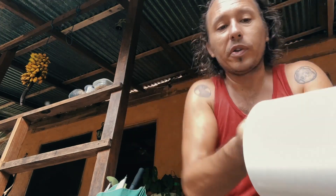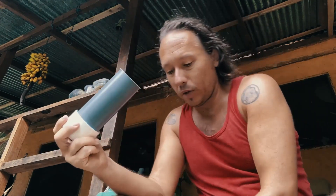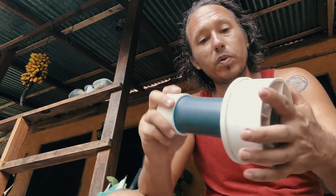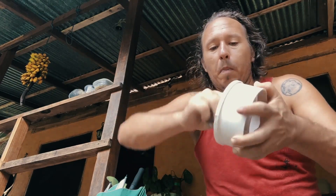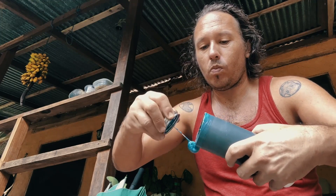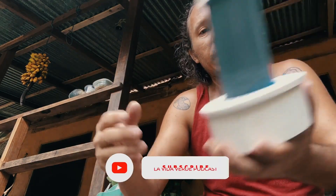Now I've got this union. I'm going to sand the inside where I'll make the connections, just like I did with all the other ones. Now we can keep gluing where we left off — what we did earlier is now completely dry. I'm going to glue that to this reducer. It doesn't feel very tight, but I'm putting a lot of glue on there — it'll work. I realized I hadn't sanded this connection yet. Then we're going to glue this into here and this onto there. You have a little bit of time before it sets — half turn — and we'll let that settle.